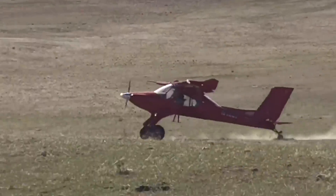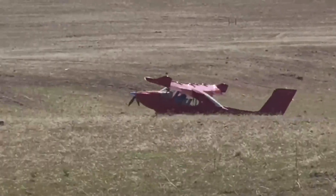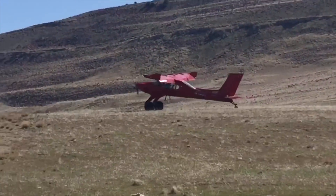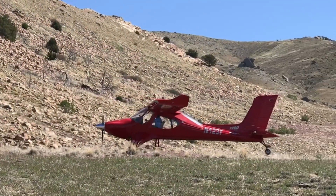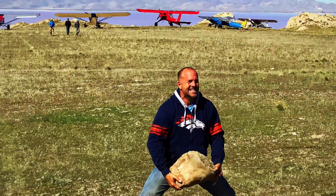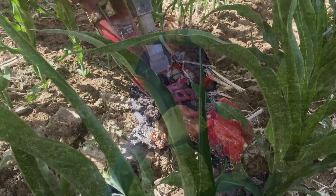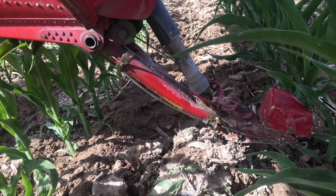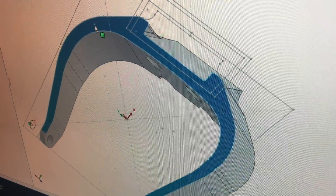In this video I've got a set of 29s and an upgraded bush wheel I put on several months back and they work really well. However, the tail wheel is still a bit too small. I've had it out in the sand and on some muddy areas and the main tires are floating while that tail wheel sinks in the mud and in the sand. A 400-pound tail couldn't keep up, so I decided to go ahead and build a new tail fork assembly.